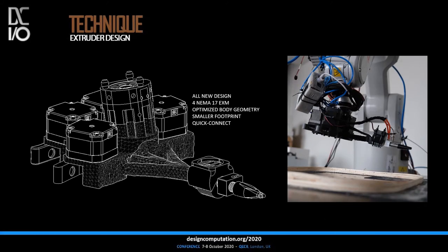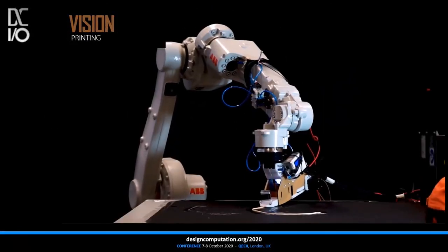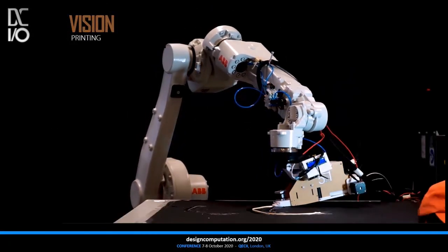As a next step, we combined an ABB 1200 series robotic arm with an additional rotating axis for continuous helical prints without a need for cutting the material, to give the design continuous strength within its shell. As you may see, the extruder design is still in development. For extrusion, a faster speed could be easily set up by using bigger stepper motors. A first part of the column design was also printed.